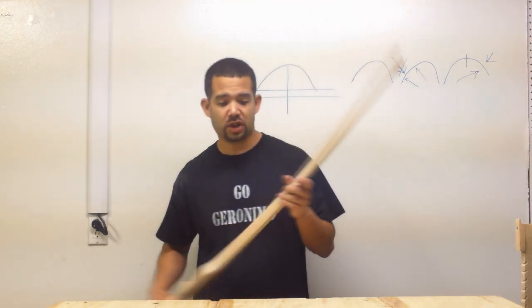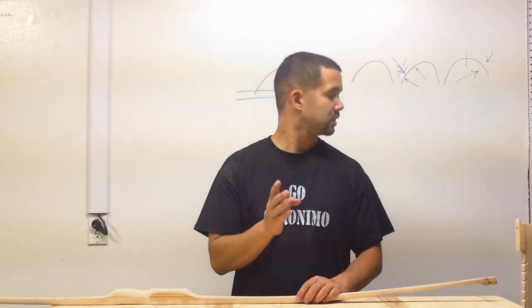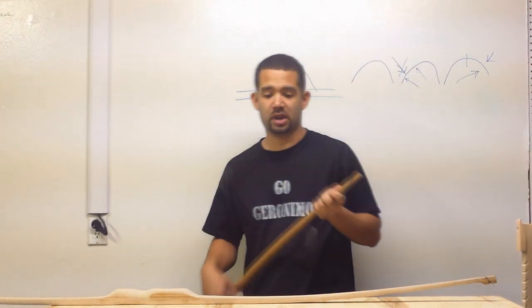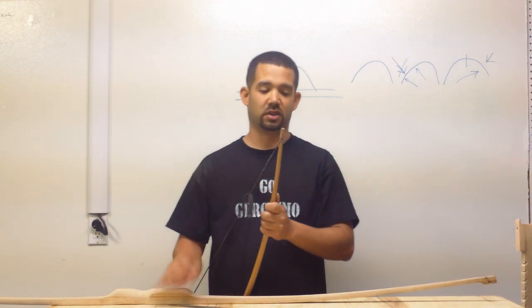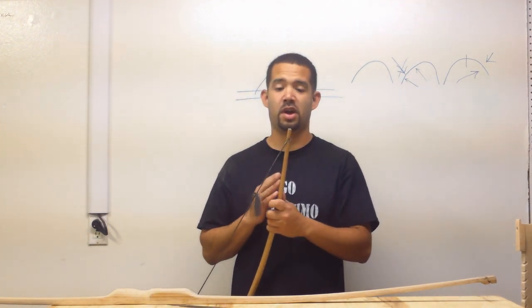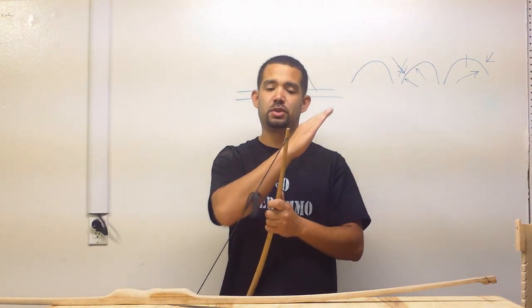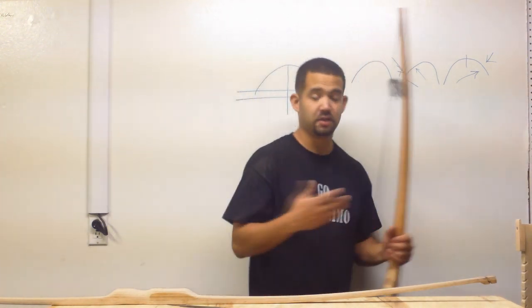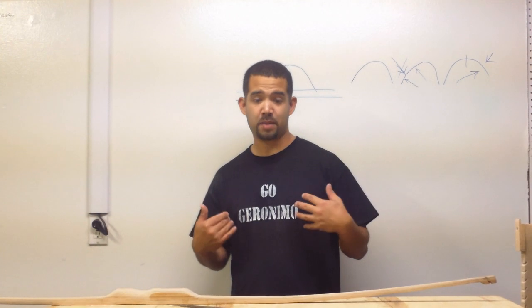I'll get you closer up and we'll show you how to do those tips, or the way I do my tips. You can do it as simple as putting a couple of notches in your bow, slanted, of course, and calling it a done deal. On this bow, which is actually the first bow I ever made, I didn't even put tip overlays. I just put 2 notches, one on each side at a slant, and that was it. So that'll work if that's what you want to do. But since this is how I make my red oak bow, let me show you how I do it.